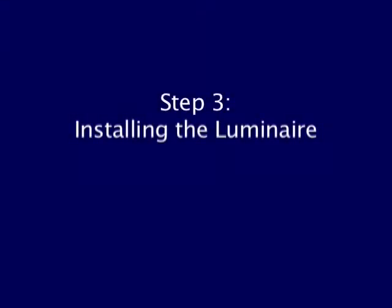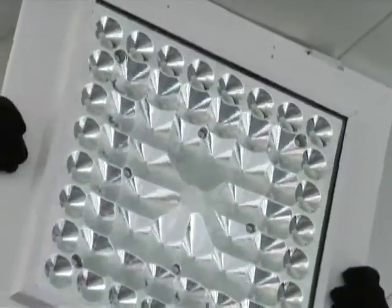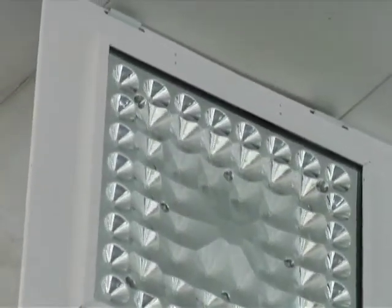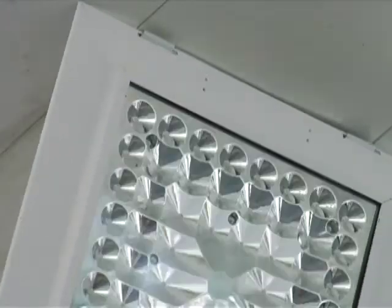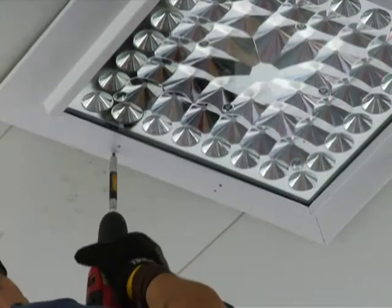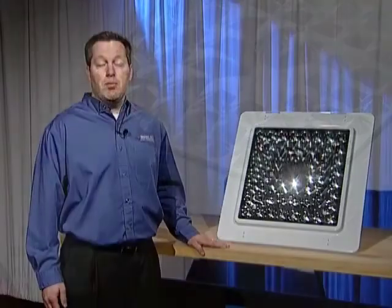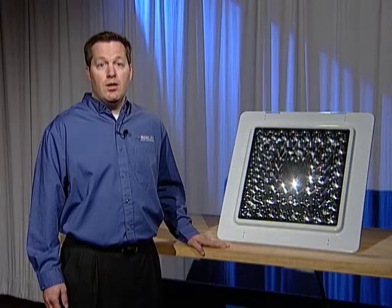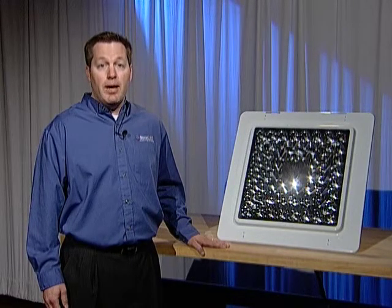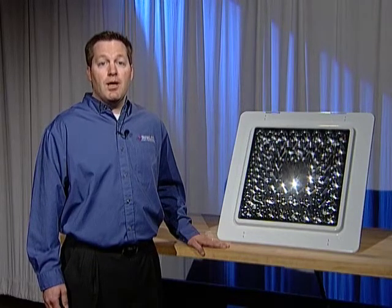Step 3: Now hang the light on the hanger bracket temporarily. This allows you to run the wire up through the center penetration. With the wiring passed through the canopy, you can now swing the light up and secure it with four more self-tapping screws, two on each side. Please note there are eight holes — the additional holes provide flexibility in mounting to an existing 2x2 or shoe box. The work on the underside of the canopy is now done. It is time to go up top.